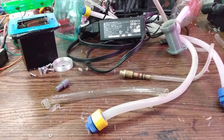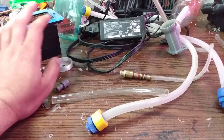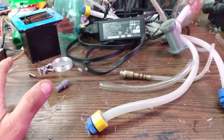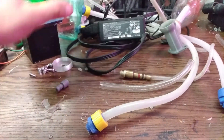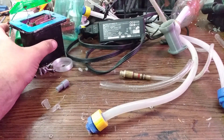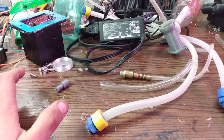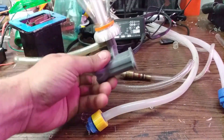I'm going to call it. I took everything off already — it seems to be a good proof of concept but there's a long ways to go. This unit and this power supply max out at about 65 watts, which seems to be about the maximum I can put through there without anything overheating. And this is just PETG, so it'll melt fairly easily — I've got to get this sorted out a little bit better.